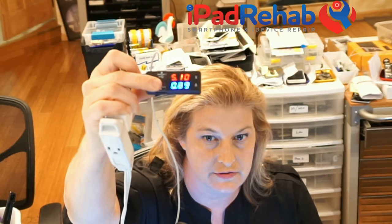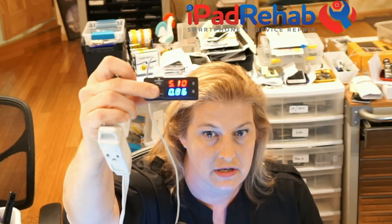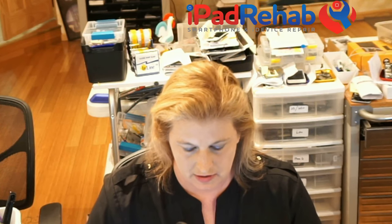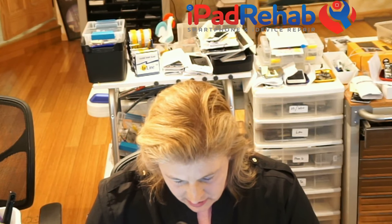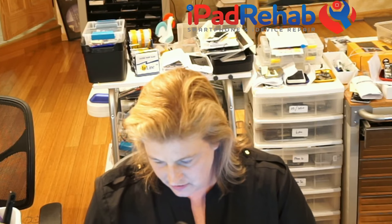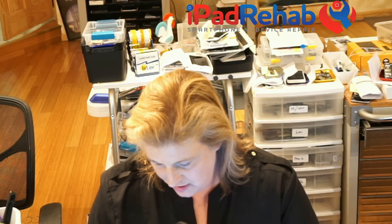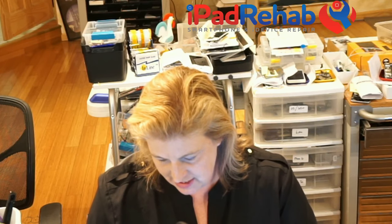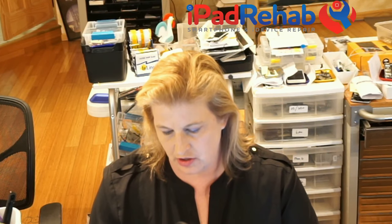All right, so I'm plugging in the cable in one direction, and it has normal charging current, which for an iPhone 5S on this charger is more or less 1 amp, depending on the charge state of the battery. The charge state is hard to see. And of course, they don't have battery percentage enabled. Fantastic. 29% charged.